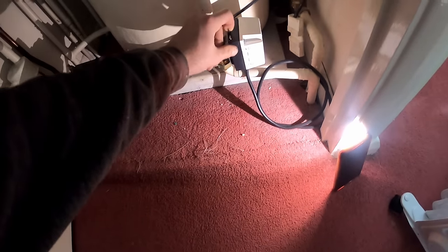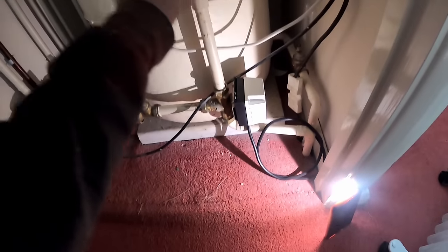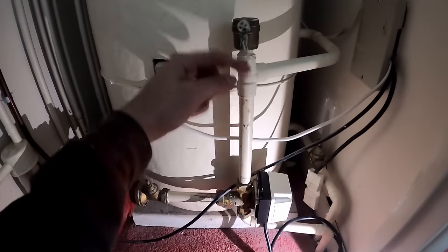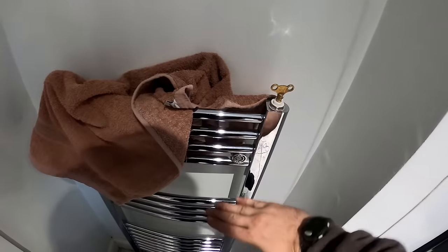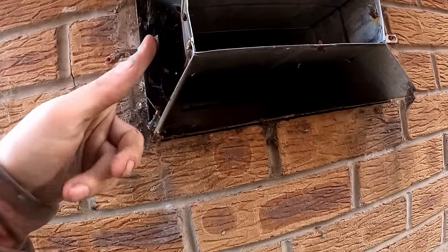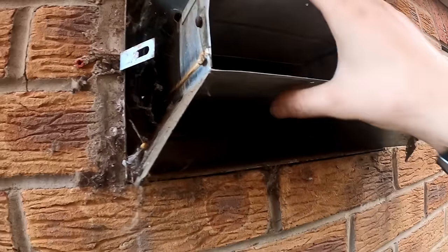Lock open that three-port. That air vent will change. Just emptying all the water out of the radiators — we'll open the air taps up. Yeah, that one's crispy; you should just be able to screw a new one straight in. It's on a screwed tee at the highest point on the system — just let them breathe in to empty all the water out. If you fold these tabs in and chip away the sand and cement, you can normally lift the boiler off with the flue on.